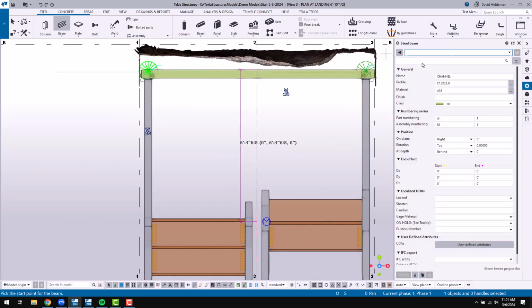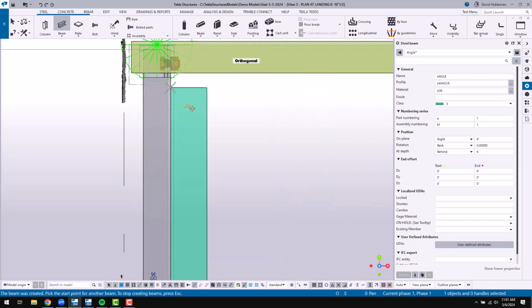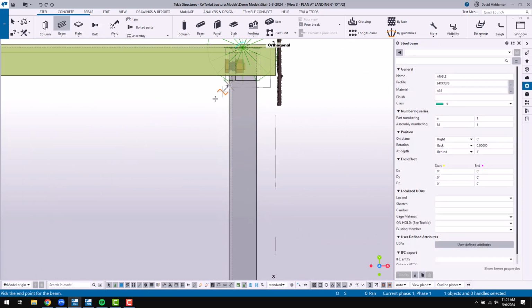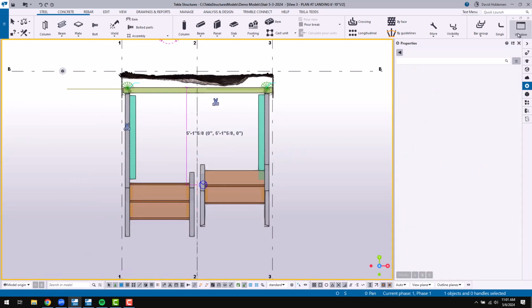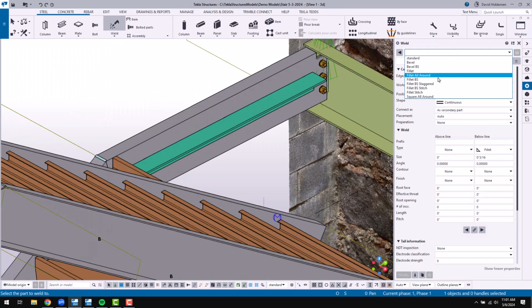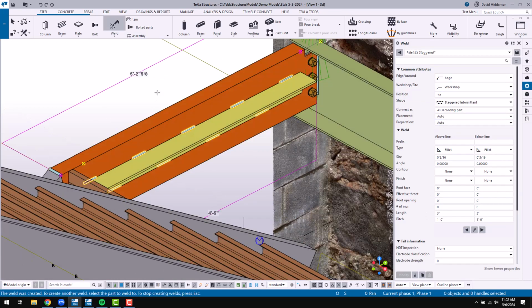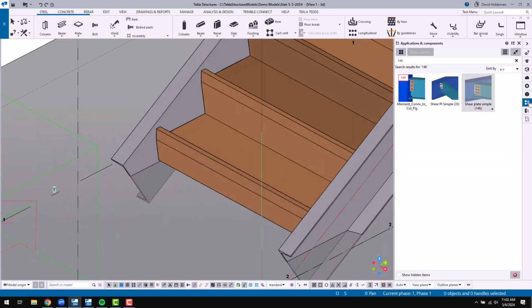So at this point, we're going to go in and add some deck support angles. I'm going back to that plan view. Again, this is something I could do later, just showing some examples of the type of framing I can do. So I'm throwing in a 4-inch deck support angle that I've got dropped 4 inches for slab depth. And then I'm going to go ahead and put in a stitch weld here, just a both side intermittent stitch weld. Again, just trying to show the levels of detail that we can get to in this 3D model.